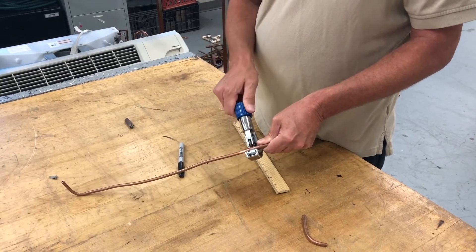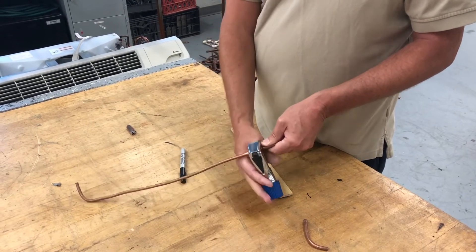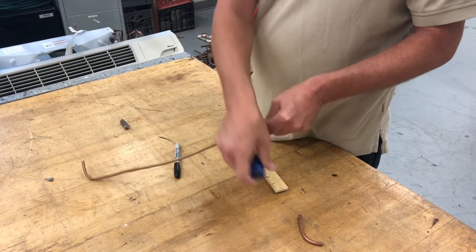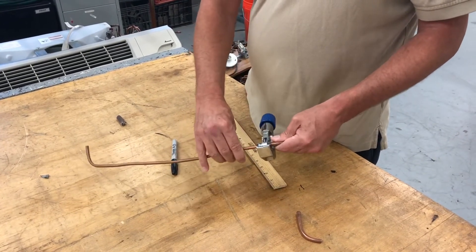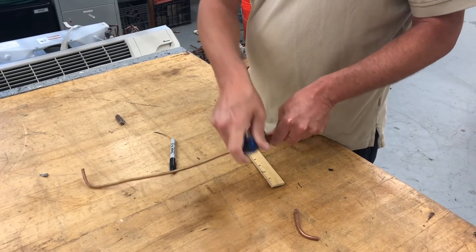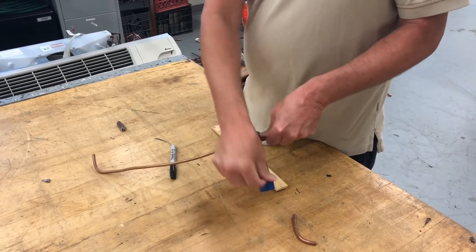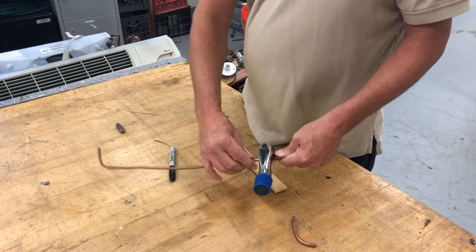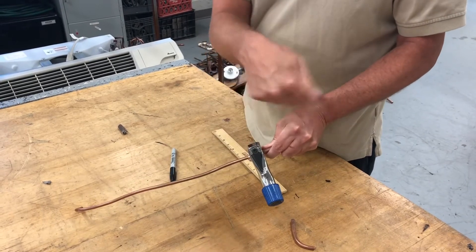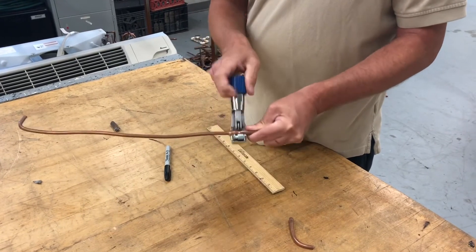I'm only going to make a groove with the tightening — I'm not going to keep going as if I'm cutting. We could tighten so far that it's not just grooving; it's actually squeezing the pipe closed and constricting it so it won't flow, and we want it to flow. I keep going around a couple of times, tightening just a little bit each time, and once I get about two or three full turns, that pipe is not going to move anymore.